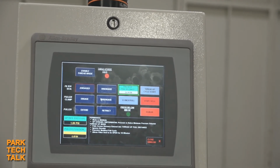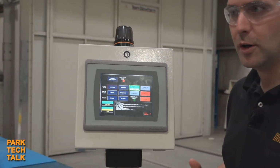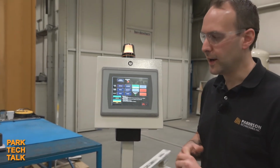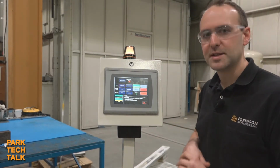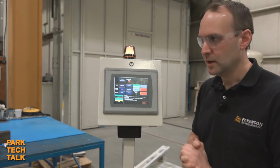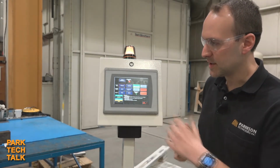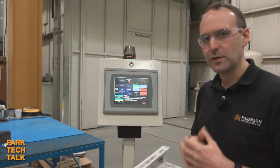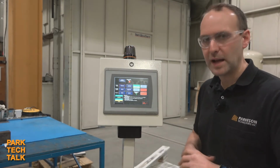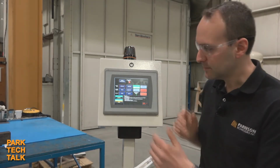So for reference, once you had linked out the depleted roll to a new roll in that inlet assembly area, you could come in here and tell it to move 36 inches. For reference, that's about the length of the KCH, especially for a traditional size 6-inch machine, and select pull. At this point, it will pull that screen automatically for that full 36 inches until that link comes on the other side, turning this into very much a one-man job.